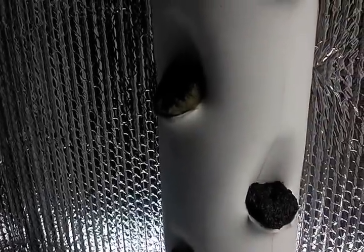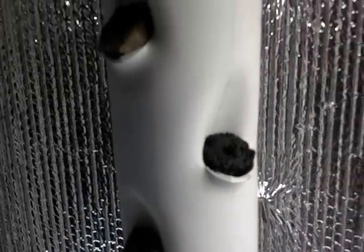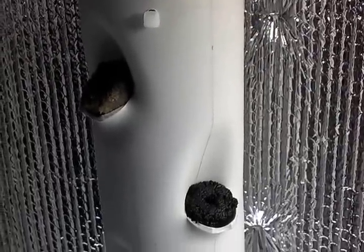The last question was in regards to manufacturing. In my final Q&A on the V-Towers, I said that 3D printing would be an option, which it is. Ew, that's nasty. But it's not the only option out there. I don't see injection molded plastic as being a viable option due to the shape of these and the mold that a person would have to make in order to perform injection molding of these towers. What I was thinking otherwise beyond that is simply designing a jig that makes the towers itself.